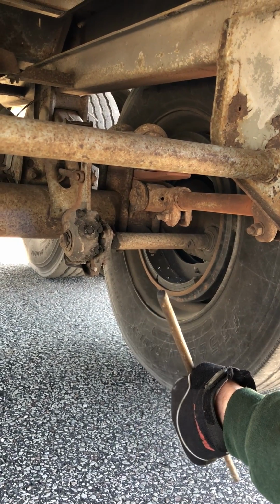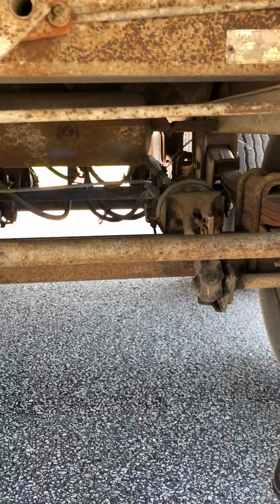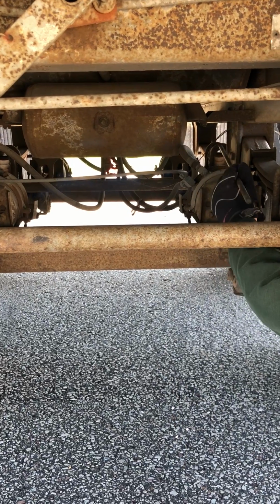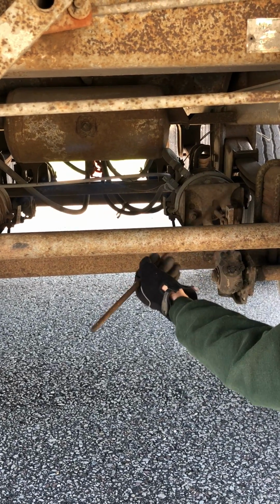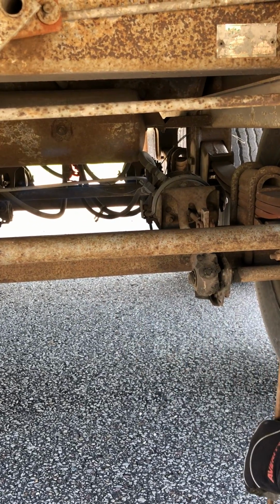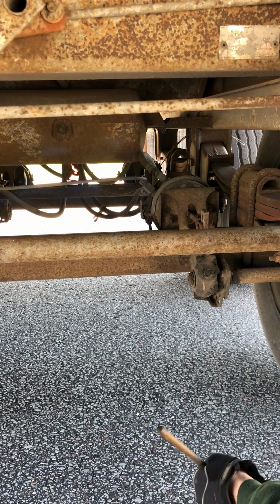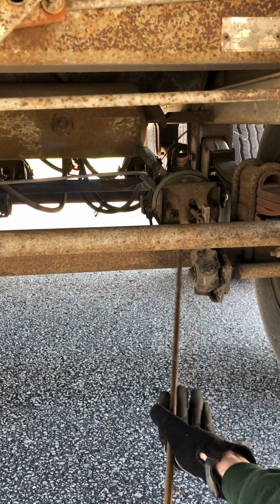Now I'm going to go to my brake system. I have my brake hoses and lines. They're properly mounted, secured, not cracked, damaged, loose, or leaking. No abrasions, bumps, or cuts. I have a brake chamber, a clamp, a slack adjuster, and a push rod. They're all properly mounted, secured, not cracked, damaged, loose, or leaking, and the clamp's present.